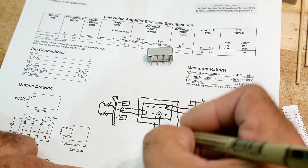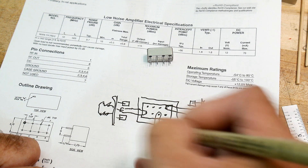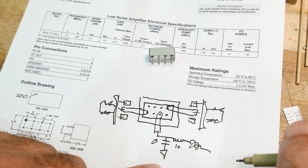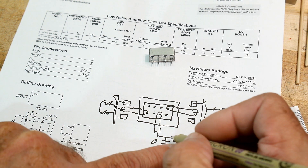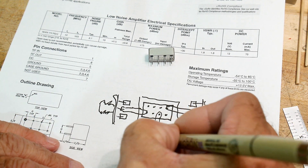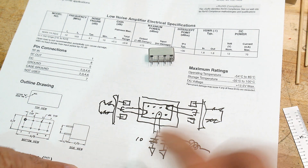On the power side I'll put a capacitor to ground and maybe a resistor — something like 10 ohms. I might think about an inductor but I'd rather do that externally. I'll put in a 10-ohm and a capacitor, and maybe two capacitors: a 10-microfarad tantalum and a 0.01 microfarad for high-frequency bypassing.